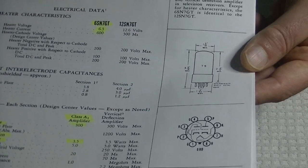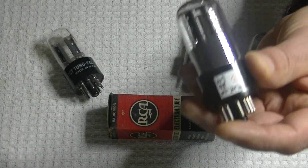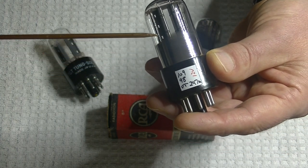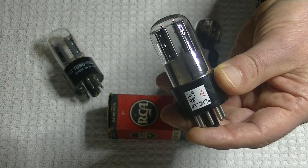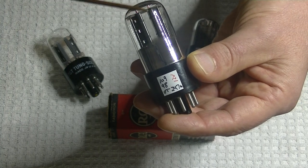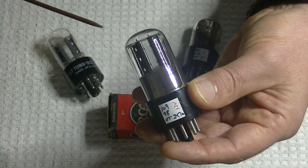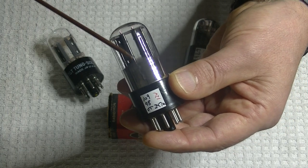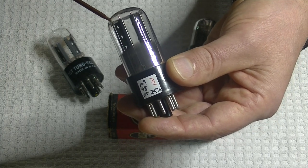So how do they accomplish this? Inside your plate assembly, running all the way up, is a little tiny rod that's a filament or heater. That element is manufactured for a certain voltage and a certain heat output. These things get really hot — power tubes get extremely hot, burn your hand off hot. By changing the filament element they put in here, they can set the heater voltage to whatever they want.